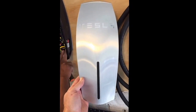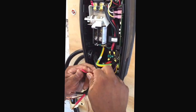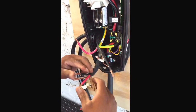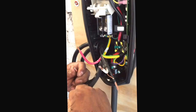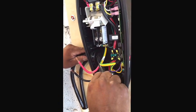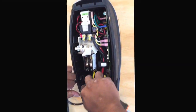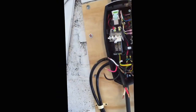Today we are wiring our 100-amp Tesla charging station using two separate feeds, each one is six gauge, and they're going to be hooked up to this 100-amp circuit breaker. That's going to give us an actual combined capacity of 120 amps, limited by the circuit breaker.